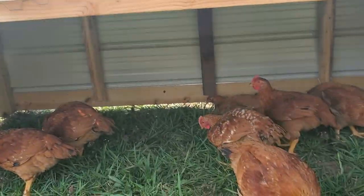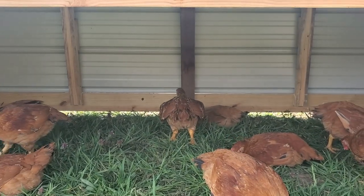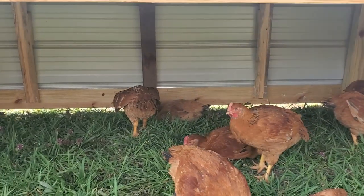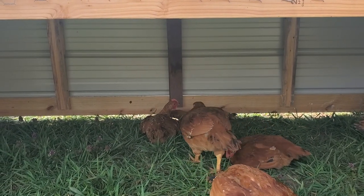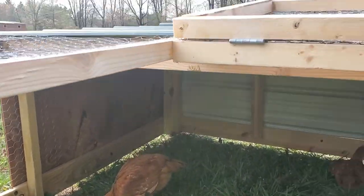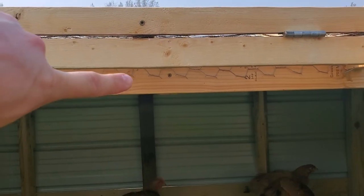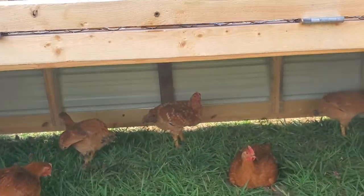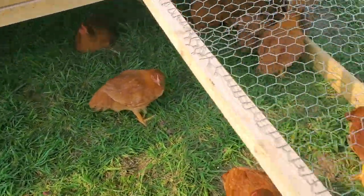In the back where it's completely covered by galvanized steel roofing, I used scrap — a pallet board and a piece of scrap cedar I had laying around — just to give something to screw the steel roofing into. Then another 2x4 over there and a 2x4 cross support underneath, which is what I nailed the very end of the steel roofing into.